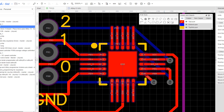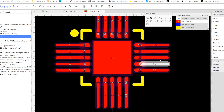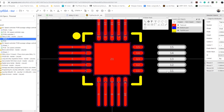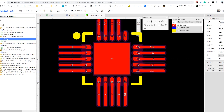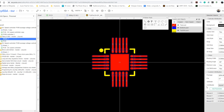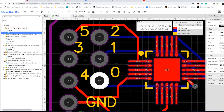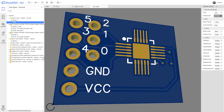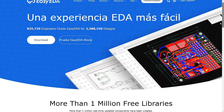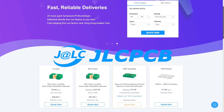During the design process of the PCB, I had to modify the footprint where the solder goes and the microchip aligns to. This is in order to facilitate the soldering process with my soldering iron. The only thing I did was to extend the pads out a little, to have much more space to work with and be able to move the solder on that surface. After completing the design, it's time to send the PCB board for production. The software I'm using is called EasyEDA, which is free and works pretty good.